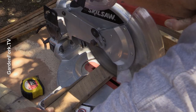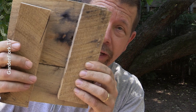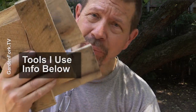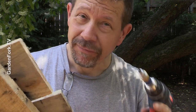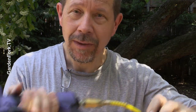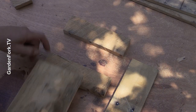I'm going to build the sides first and then connect the front and the back. To do this I'm going to use a brad nailer — these are really handy, I'll link below to the ones I suggest. I'm going to brad nail it, and then after we put it all together and it fits, we'll screw it together. The beauty of the brad nailer is these brad nails are thin, they go in quick, and if you want to take it back apart you can just break it apart.